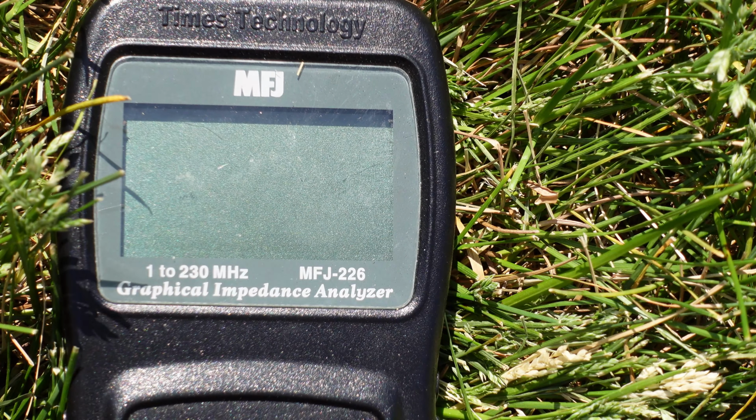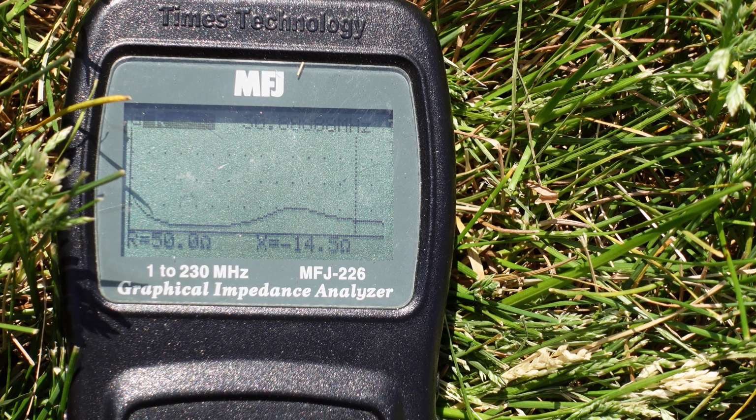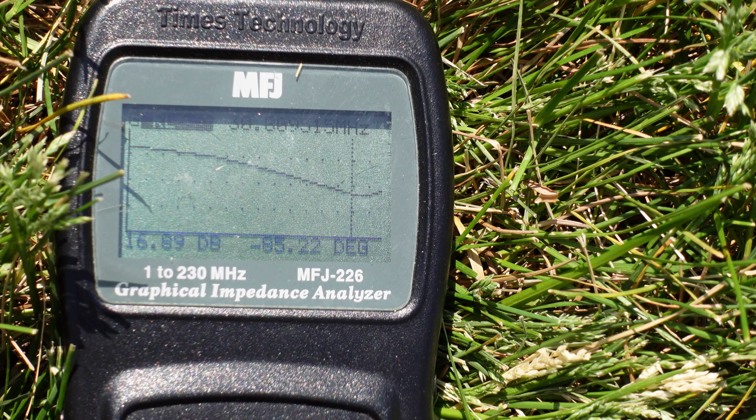Now if we go to our resistance, which will actually show our reactance, we're going to see here our X value does also, I guess that would be decrease. And now I forgot to show this, but this is the return loss chart, okay? And I did see this on another video, which I'll link below, but here I have my return loss. And there's a nice dip in there. We're going to leave it right where it's at, and we're going to put the carbon fiber right in front of it now.